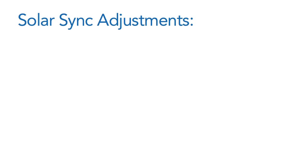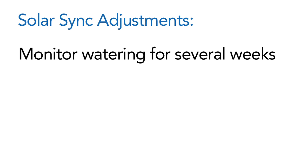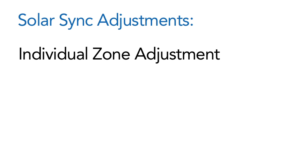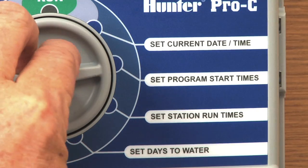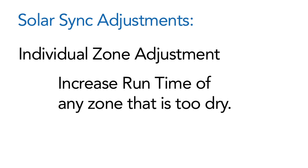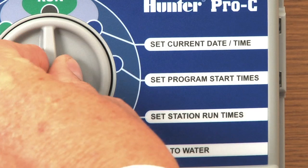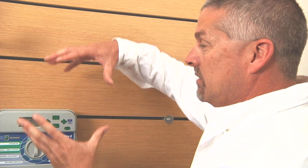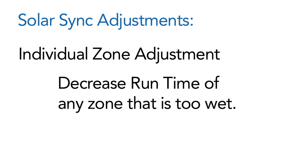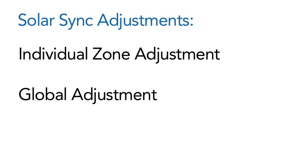Down the road as you watch this system, check it at 5 days and 10 days later to see overall performance. You'll have two situations: the first is where you have 10 zones and all 10 are working great except one that's a little dry. In that case, go to set station run times, select that station, and increase its run time by a few minutes. Once it's individually increased, go back to run — when the entire controller adjusts up and down, that station starts at a new benchmark. If a station is too wet, you can reduce the amount of water on that station and go back to run.